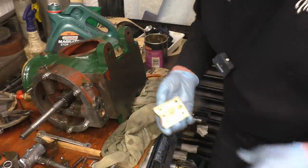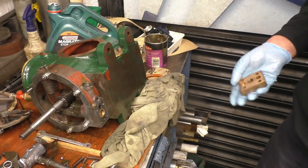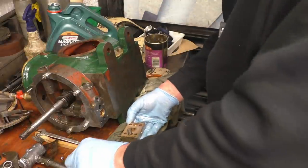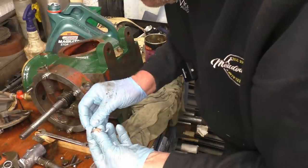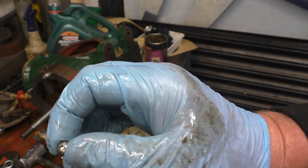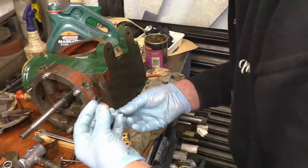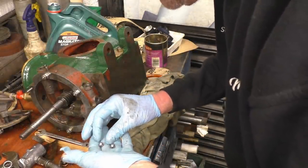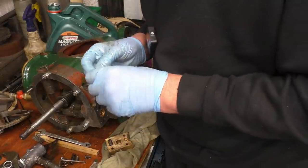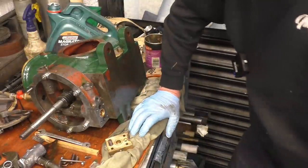Let's see if there's anything to see in there. All the little seats look good. Make sure I've got a big spring in there — balls are all the same size. Right, we've got an issue here: there's a bit of pitting on that ball. That's all it would take to stop the pump working. I didn't notice that when I put it back together. This will need some new balls. At least I found a reason why it was blowing back — if that little bit of damage was on the seat it would just bypass it. That would cause all the problems.